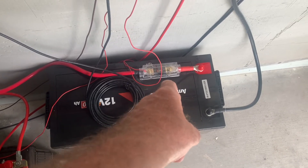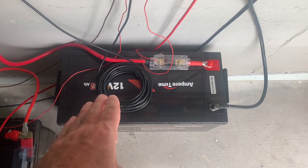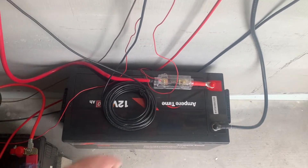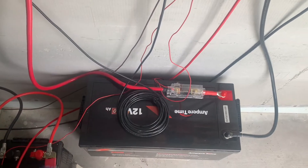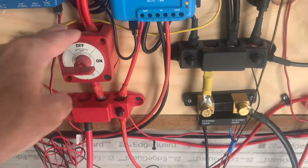This battery is also able to pump out quite a few amps, so this fuse is also critical. That fuse is rated to the maximum that the battery can kick out — at 280 amps, so that's a 300 amp fuse. On mine I've got an on/off switch rather than a breaker, because this is more of a marine-type environment.